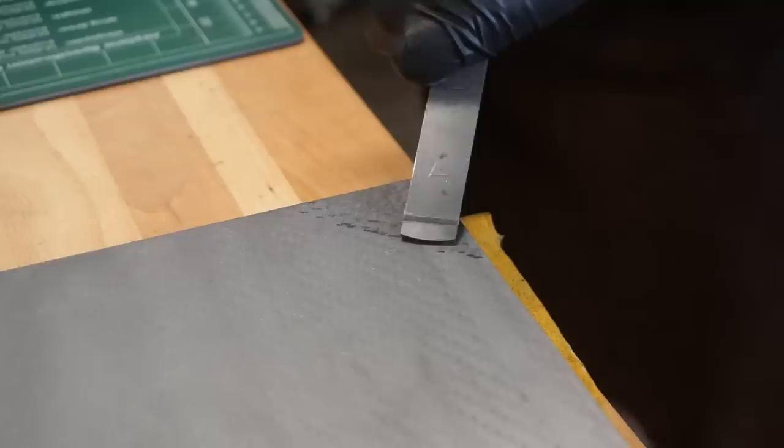You want the spacing between each of those to be about the same width as each of your cuts, and you want the depth to be all the same. That's the basics of scraping. So consistency, I keep coming back to that. And I'm only taking like a quarter-inch, almost close to finishing cuts.